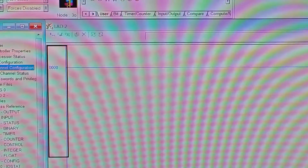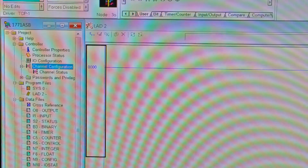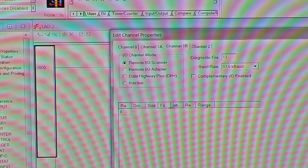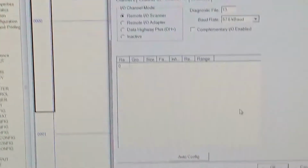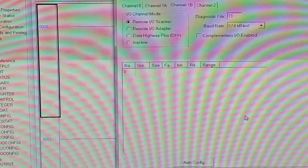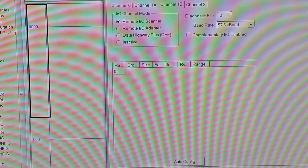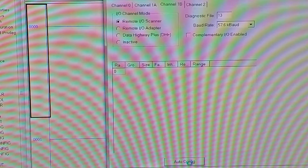Let's go back here to our channel configuration. We go back to channel 1B. Okay, so we know we're at 57.6 because we confirmed that earlier. And channel 1B is our remote IO scanner. We hit, and our diagnostic file, which has to be there, holds all of the information for the chassis that are out there. We hit auto configuration.